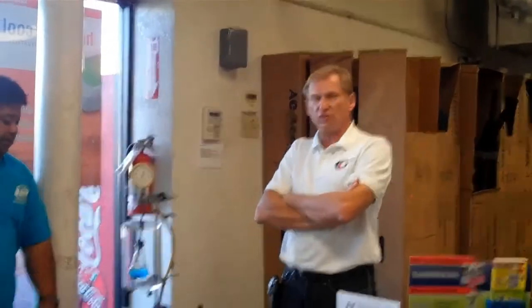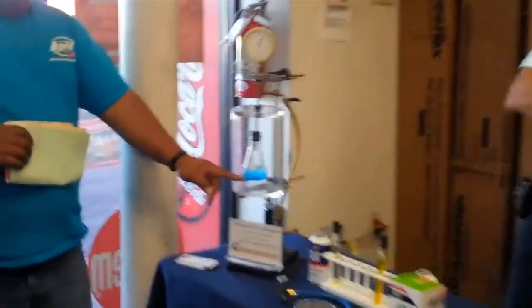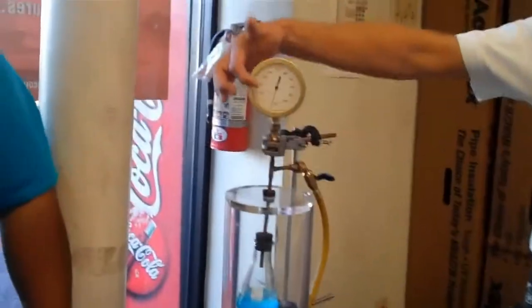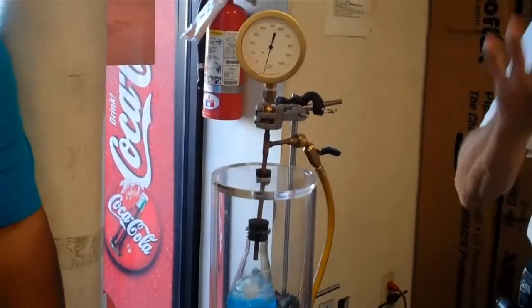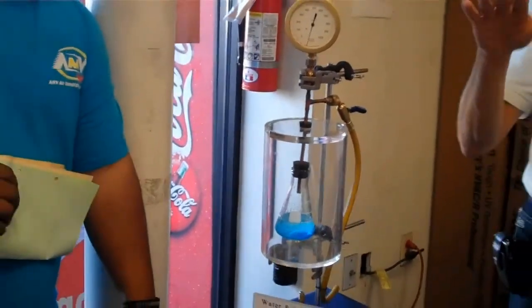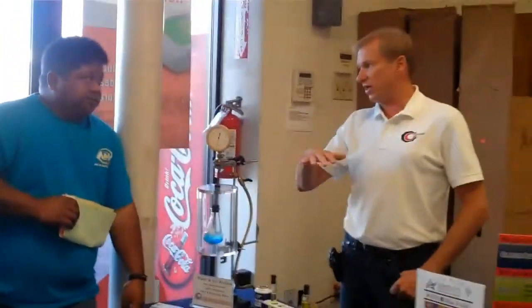Look at the Infinity Vac. See all that blue on the bottom? That's the water. This is a very deep vacuum we're seeing here — it's probably 20 microns, which you don't get in the field. You're happy if you get 500, under 750. ASHRAE says under 1,000 for an hour.